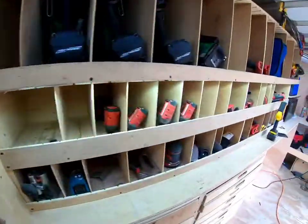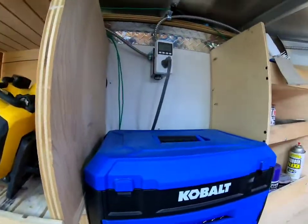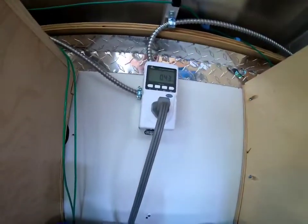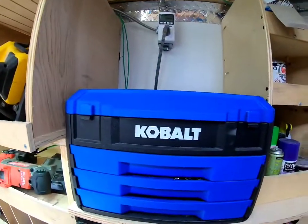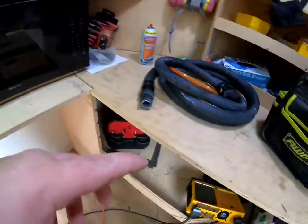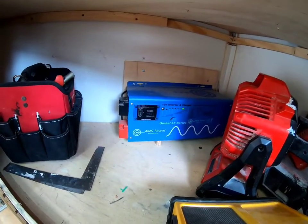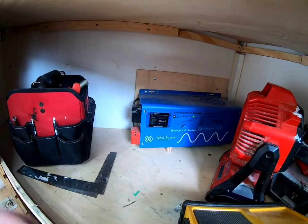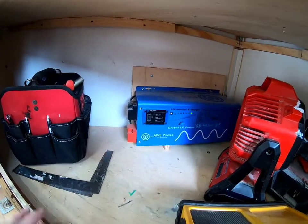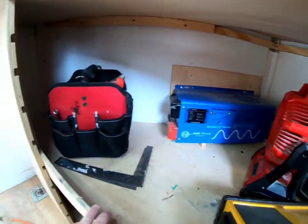Microwaves are really, really thirsty. I'll say this — I'm actually charging the battery, so we're not running off the battery right now. We're running off shore power connected to my DC batteries. That's just the usage for the microwave and the charging station. I'm still losing efficiency from my inverter converting 12 volt battery bank to 120 volts. The inverter is probably about 90% efficient, so I'll get some equipment to test that to see exactly what my inverter is drawing.